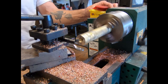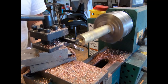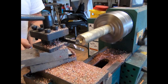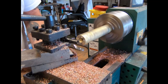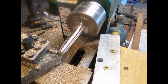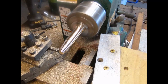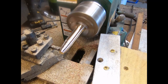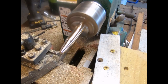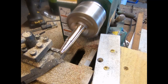I just poured it into these painted steel molds. I sprayed a little high-temp ceramic paint in there to stop it from literally brazing right to the steel. And we end up with something that looks like this, at which point I just turned it on the lathe and eventually came up with some really nice looking round stock. This particular piece gets turned into a cone, and I made kind of a makeshift taper attachment. You see that piece of aluminum screwed down to a stack of wood blocks? This is the Grizzly Mini Lathe, by the way — I'm pretty happy with this little thing.